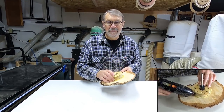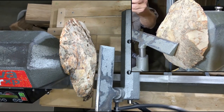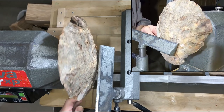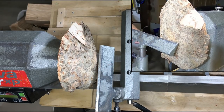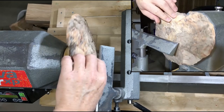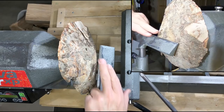Using these large calipers I found that this is at the very most one and five-eighths of an inch thick, so I'm not going to be making anything terribly deep. I'm going to start by turning this at 1000 RPM using my three-eighths inch bowl gouge to create a flat spot. I'm hoping to be able to put a recess in and use the expansion mode of my chuck.